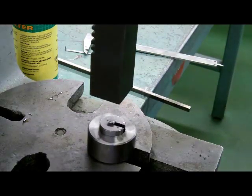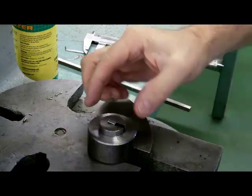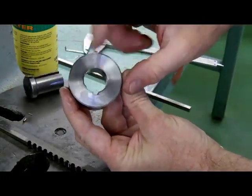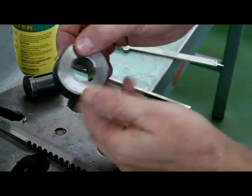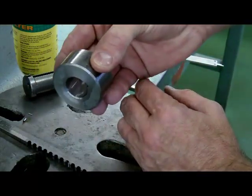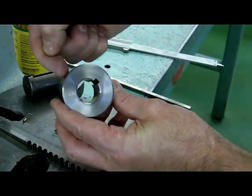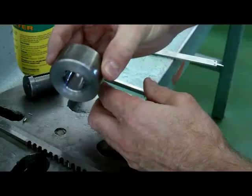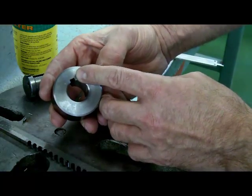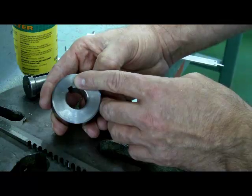What we would do is repeatedly end up putting shims in the back until we got out to the diameter we needed for this key seat. There are going to be burrs inside the bore and burrs at the top and bottom of this groove, and we would just take a file — probably a needle file — and clean that up until it slips nicely over the shaft. Sometimes we'll actually drill and tap and set screw on top of the key, or set screw at 90 degrees on the shaft, so this isn't moving back and forth, but again creating that drive between the shaft and this sleeve. Again, this is a keyway which is in the bore; the key seat will be in the shaft. The idea is to create drive from one moving component to another.